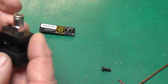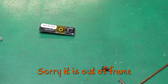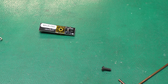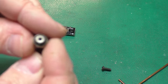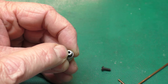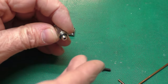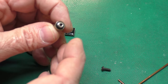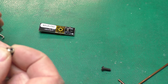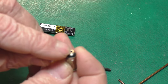I got most of the fuzz out of there. Now I need to pull the tube coupler off — that is an 8-millimeter. The problem is right here: there is no radius on that edge. So when the filament's coming up through there it still has an arc to it because it came off the roll. Some filament retains more of that arc than others, some has a slightly different surface texture, there might be a little twisting — so this doesn't sit all the way down into the pocket, and the filament catches on that edge.